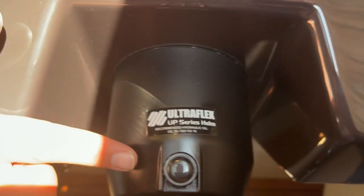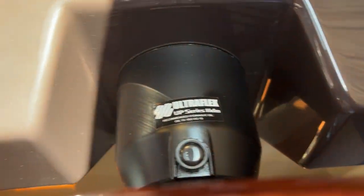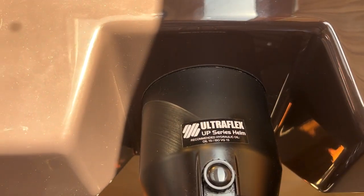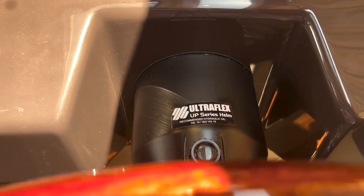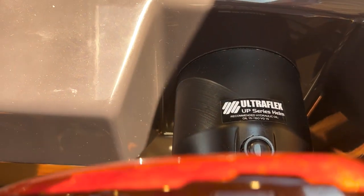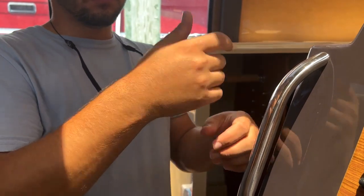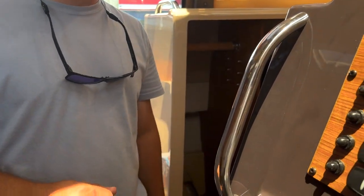This cap comes off, and then you can fill the hydraulic steering fluid. Gotcha. The way they do that, there's a little adapter that screws onto this, and a little tube, and then you buy the hydraulic steering fluid and squirt it in the tube, and you turn the wheel left to right constantly. As you're doing that, you'll see the bubbles come out of the system, and once the fluid is where you can see it in the line where it's full, you can turn it the other way, remove the line, put the cap back on, and you're good to go.